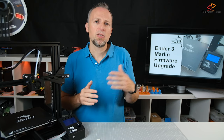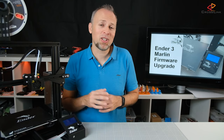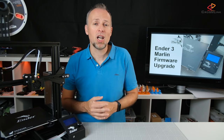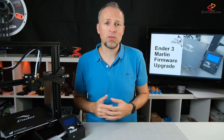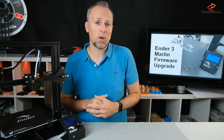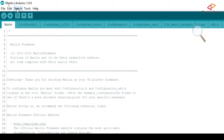This is a little tricky if you want to use all the advanced features Marlin offers, because the flash memory of these cheap printers is very limited. As a final resort, you can disable the SD card feature, but this will take away the ability to print from the SD card. Instead you can use OctoPrint, but this requires additional hardware — either a computer or a Raspberry Pi — to control your printer. If you still don't have enough flash memory and don't want to disable a specific feature, you can flash the firmware without a bootloader and gain a few kilobytes by using all available flash memory. To do that, connect your programmer to your computer and to the ICP port of your printer, and in the Arduino IDE use 'Upload Using Programmer' instead of the regular Sketch Upload.